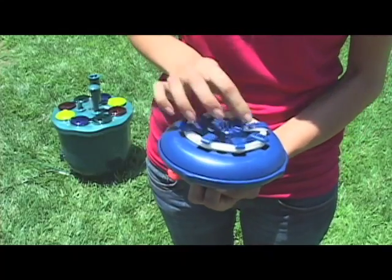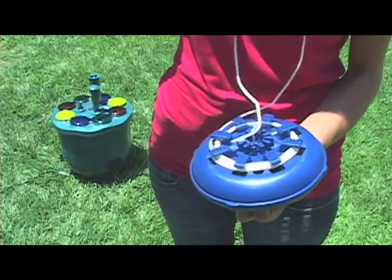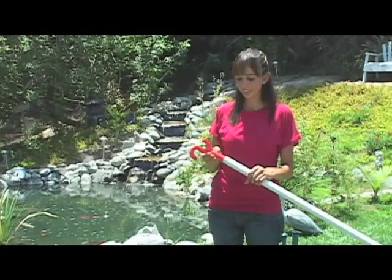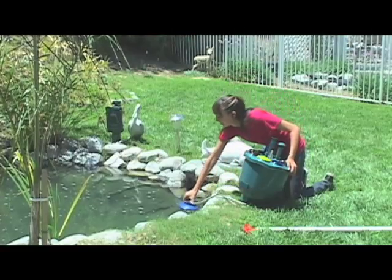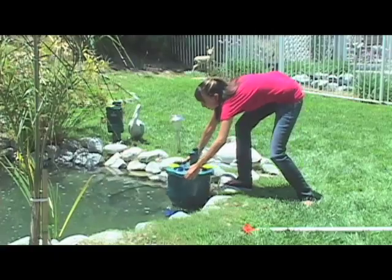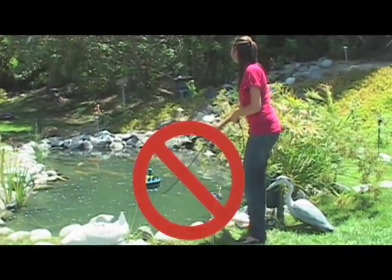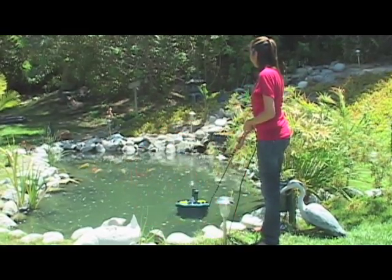Step 9. Adjust the anchor and attach it to the bottom of the unit. Step 10. Attach the anchor locator into a standard skimmer pole. Step 11. Position the fountain and anchor in the pond in the area you choose. Note: Do not use the power cable to keep the fountain located in the center of the pond. Constant pulling on the cable will damage the wires over time.